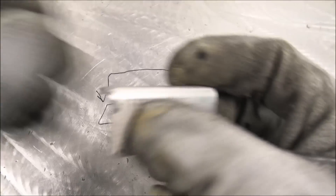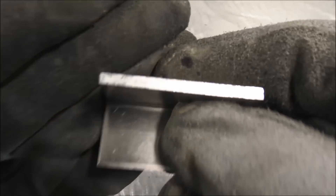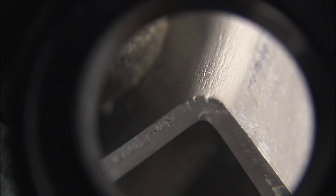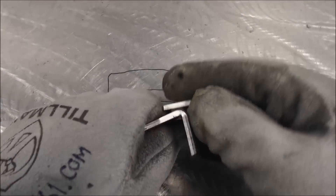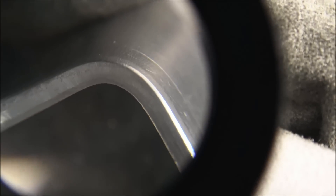Looking at the width of grain: it's going that way, so that side was thinner on the top and it cracked as expected. The other side probably didn't crack as bad — yeah, a little bit better, but there's still a decent crack in it. The main thing is just don't bend them so tight and they won't split on you. Give it a little bigger radius so it can stretch around smooth and not crack — see how nice that is, no problems.